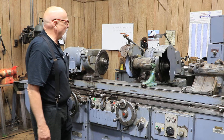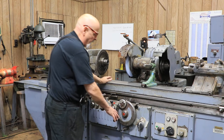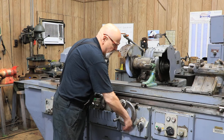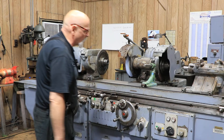The wheel head has a lot of range in it. You've got a lot of travel in and out with the hand wheel, plus you will have a coarse feed — you can switch this so that it feeds a lot faster when you turn the hand wheel. And then it has the regular external mode for normal grinding.